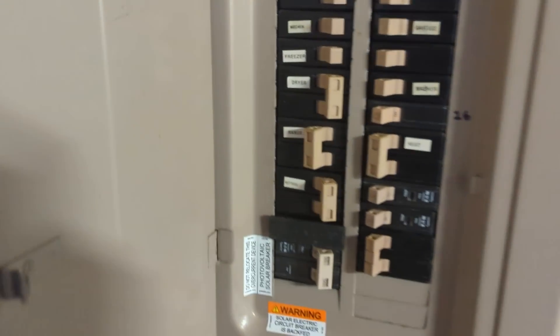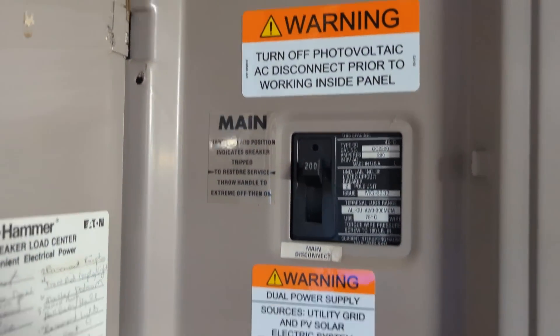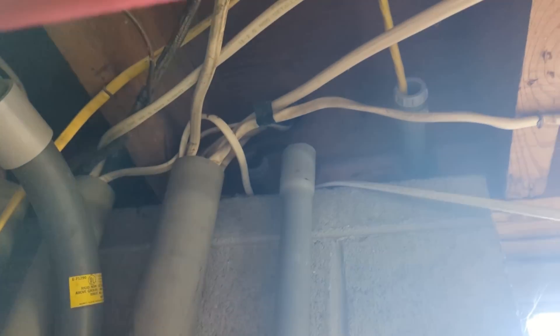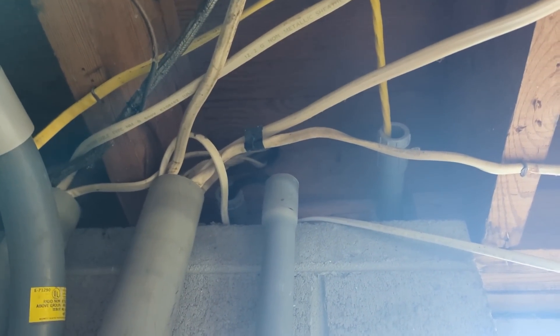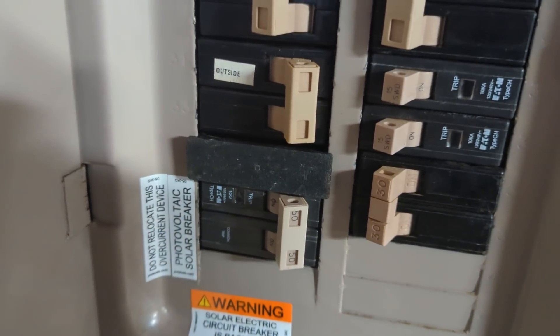You use the Enlighten app to monitor and check production on each solar panel. We've passed our inspection — always a good day. Here's our photovoltaic backfeed breaker, 50-amp, in this Cutler-Hammer panel, labeled with an NEC 2020 label kit. Outside you'll see the combiner and the disconnect. We've got our 12-2-2 circuit taking our two Enphase circuits out into the combiner — 20-amp BR breakers in there — it combines them, then we have our connection to the lever disconnect, back and forth, and landing on that 50-amp breaker.